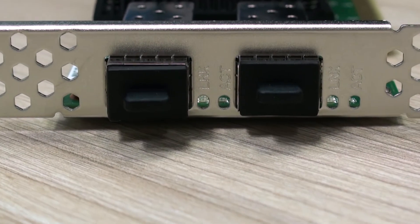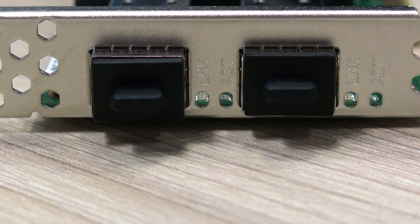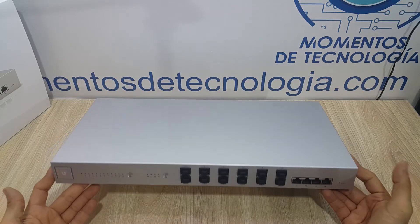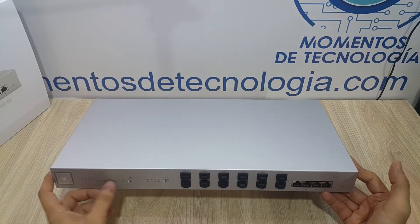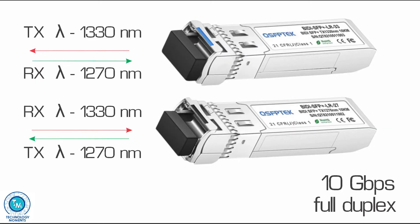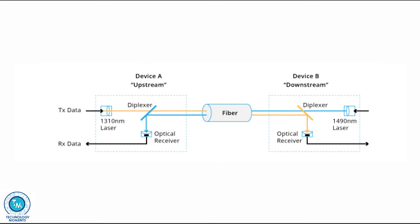These 25 to 100 gigabit per second networks may share a lot of hardware as we've seen in our channel, particularly one technology that is going to be discussed in this video, which is called data multiplexing. This actually lets us use one single optic fiber cable to transmit several or many data channels, each in different wavelengths. This is applicable to absolutely all optic fiber cables out there.